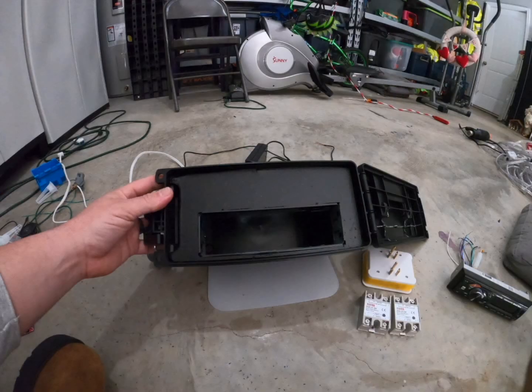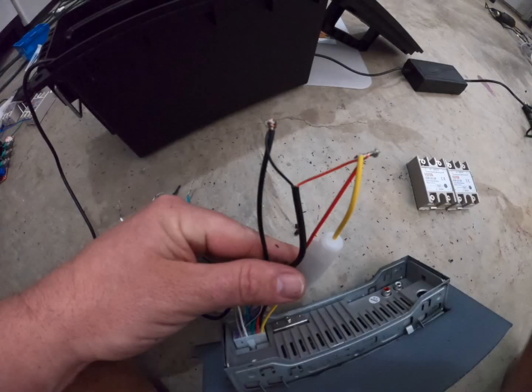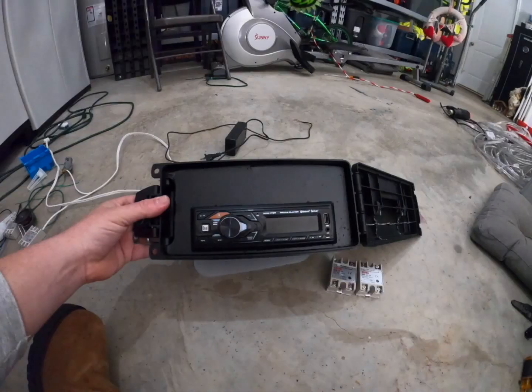Super simple — I just cut up my cutting board, spray painted it black, made a hole for my radio, and it fits right in the box perfectly. I took my 12-volt power supply red wire and added it to the red and yellow wires on the radio, then took the negative black wire and hooked it up to the negative on the back of the radio. That's going to supply all the power we need for the radio. I just wanted to make sure the radio fit and I had clearance for the plug adapter in the back.